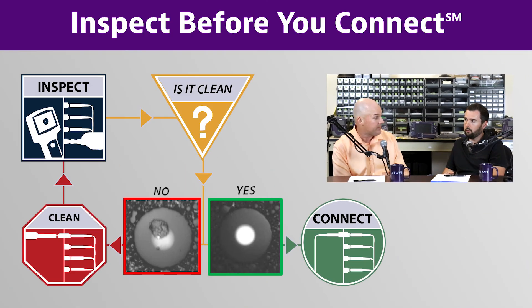It's a great connector — a little bit different, kind of like cars and pickup trucks: one's not better than the other, it just depends on what you're trying to do. With MPOs you just have to treat them a little bit differently than single fiber, but still using the inspection and cleaning process and looking at the end face for defects is important.